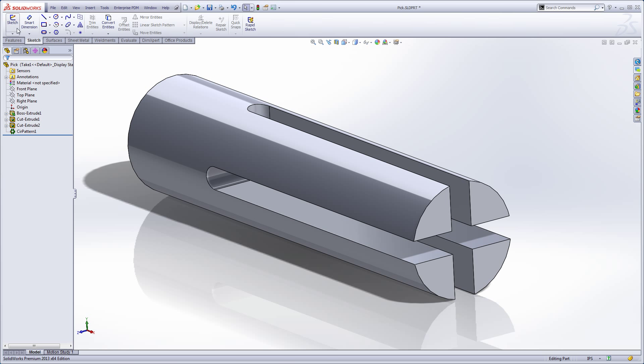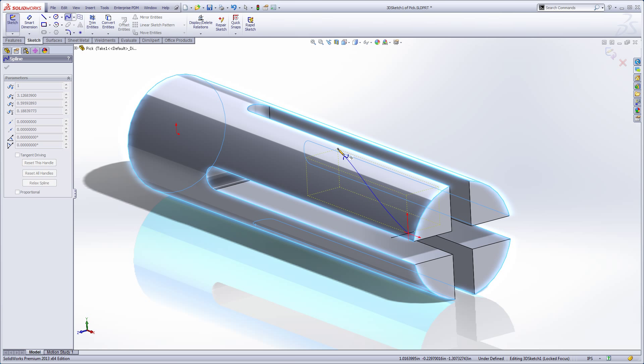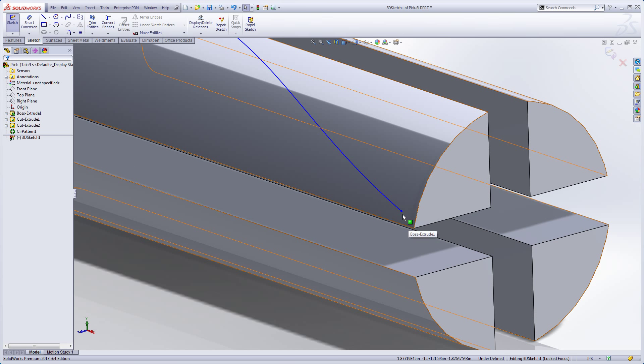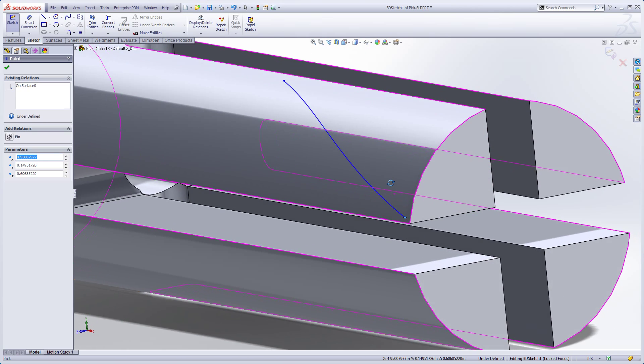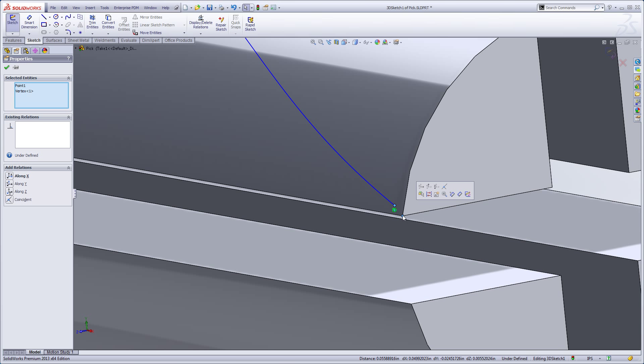The first concept starts with some 3D sketching — a little bit of advanced 3D sketching too. I'm going to pre-select on that surface and say 'spline on surface.' I'll just pick two points and go into select mode. I didn't put them exactly on those little end locations so that when you drag it you can see that we are directly on that cylindrical face. The spline is just contouring through those two points. Now I'll pre-select both those points holding down control and say merge.